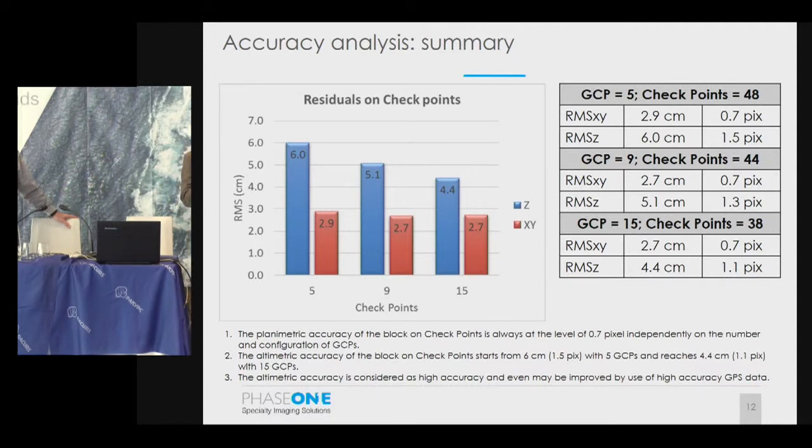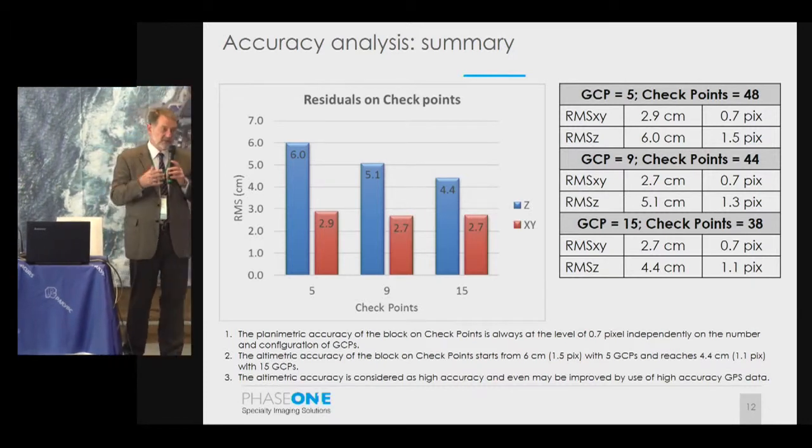You have one parameter, it's for aerial triangulation. The second parameter is stereoscopic measurements. For stereoscopic measurements, it will depend on your focal length, on your forward overlap, all this stuff, because it forms your accuracy. We can predict the accuracy that you will get for stereoscopic measurements, because it is relatively easy to estimate and calculate.